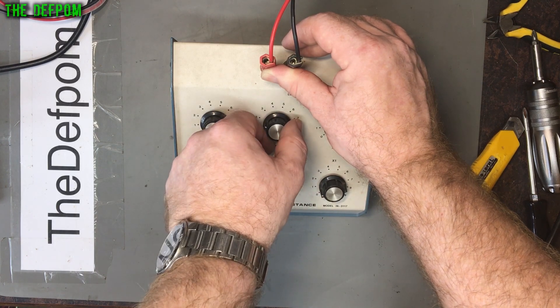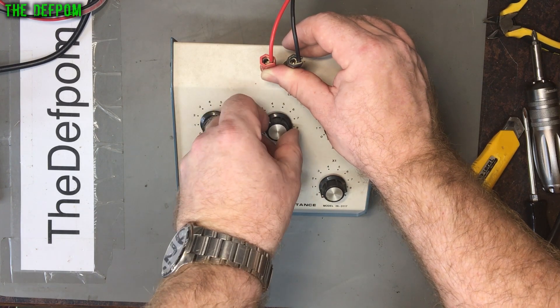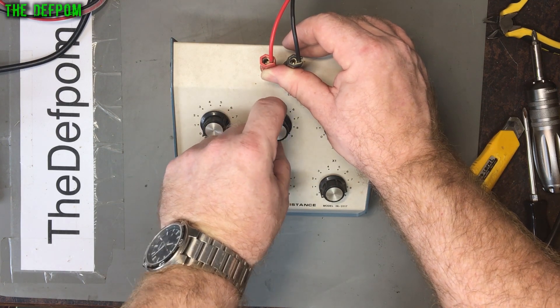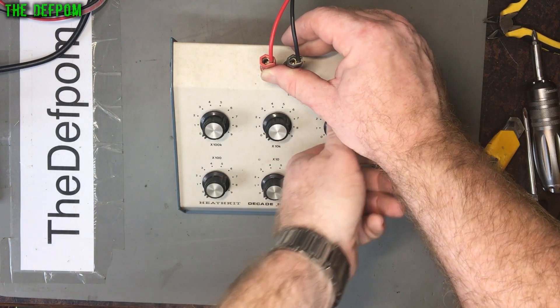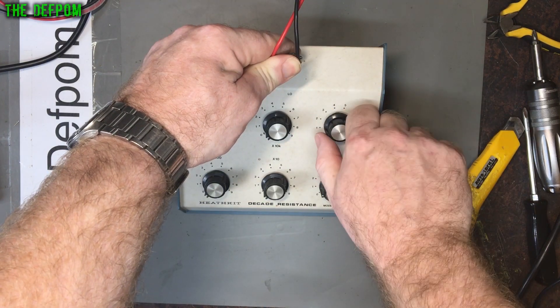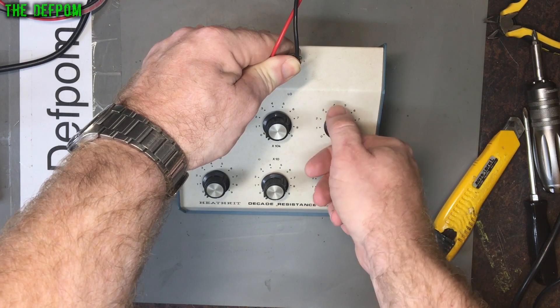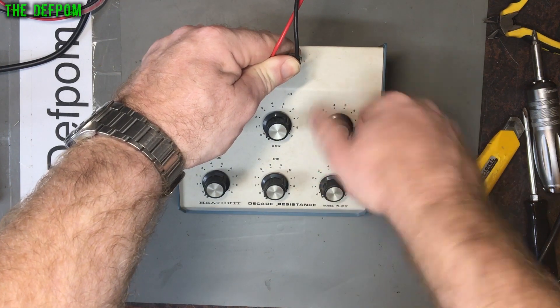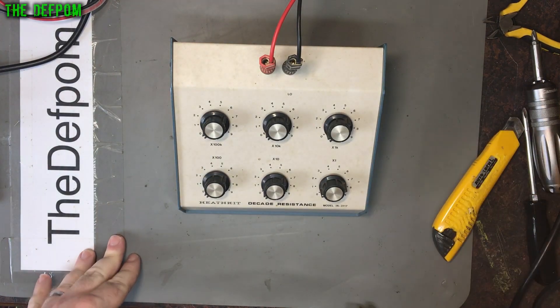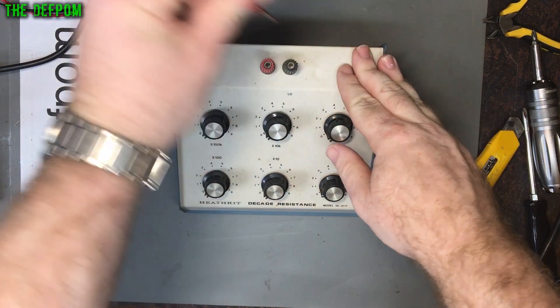It's 10.1k, 20 exactly, 30 exactly, 40 exactly - you know, those different digits work out. The switches feel nice. I'm thinking the switches are dirty based on the way it's jumping around a little bit. Going back to it, it seems okay after that. I'll get that cleaned but it seems to be working at least mostly. Let's open it up and have a look.